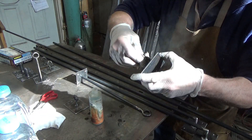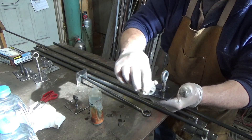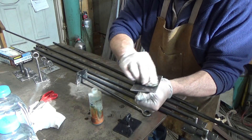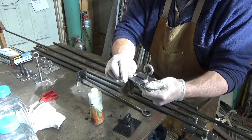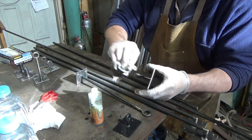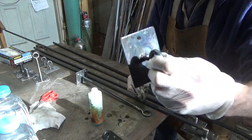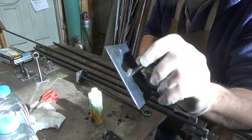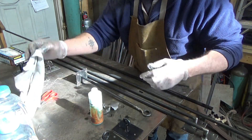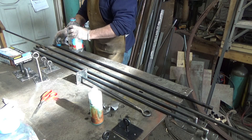Being more generous with the product, it blackened right up — beautiful. These parts I probably could have dipped. When you're working on a large flat surface like a sheet of steel, you'll have to really practice so you don't end up with streaks or spots. These pieces are relatively small so I'm not too concerned about that. This one has a second coat and you can see it's much darker now. Not totally black, but much darker. The rod back here is ready — they say 60 seconds and then water. You don't have to neutralize it with anything, just plain old water.